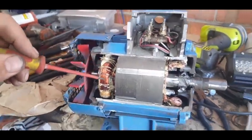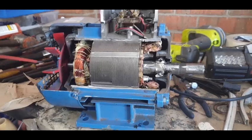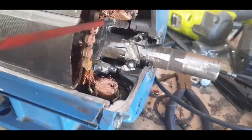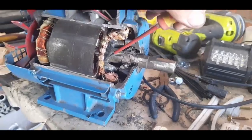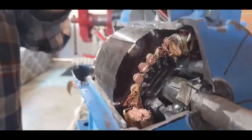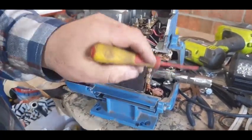I'm going to edit all this together and make one little video for you to watch. That's the basics of cutting out a motor and making it so that you can actually see what's inside of it. I can't turn it because the bearing has collapsed on this side — I had to cut the shaft, which took a little bit of work because it was like an alloy ring. I pulled some of the laminations off so that you can have another look back in there and see those teardrops and how they interact.